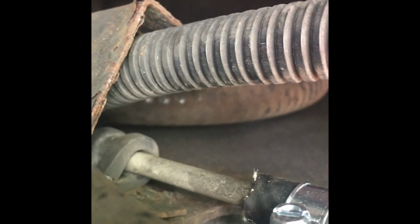And then on the underside here, there's the old fuel filter connected to the new pump, new hose and clamps running over to the hard line. And actually I did notice while under here there is another place where I should replace the hose, or at least inspect it. The hard line goes along the fuel tank, and I don't know if you can see it, but it does go back to a rubber hose right there, and it goes up through the frame and I assume over to the fuel tank. Unfortunately, I don't think I can replace that one, so I'm just going to inspect it, and if there's a problem I'll probably have to have the dealer take care of that.